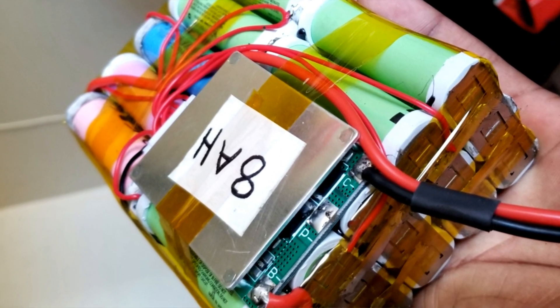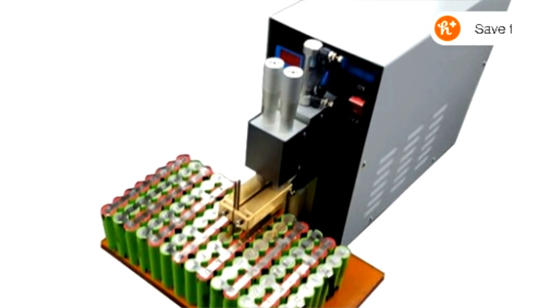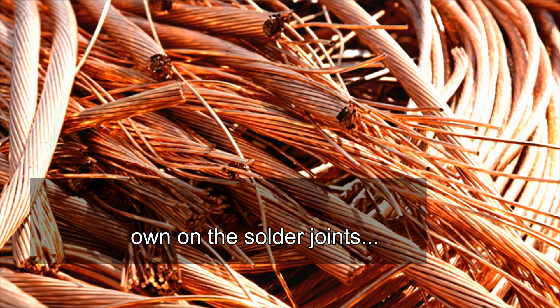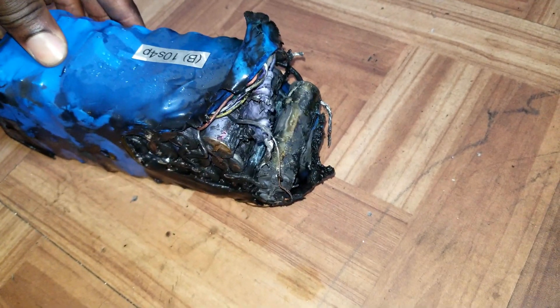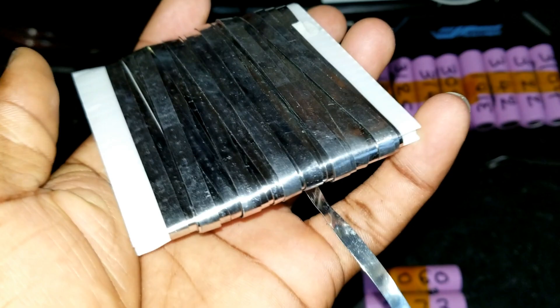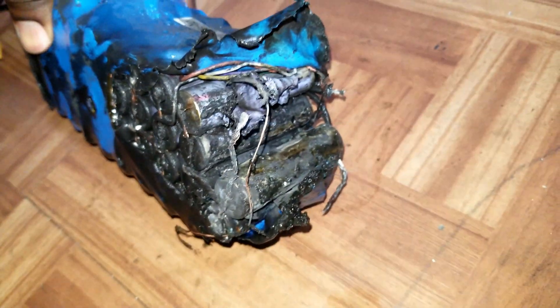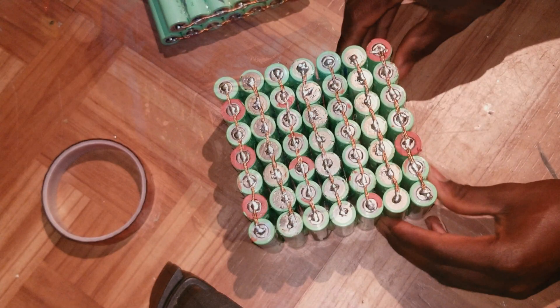Except if you are using a 1S battery. If you are soldering your batteries instead of welding them, make sure you stay away from stripped wires, as they can break the top caps of your batteries and lead to shorts which can cause fire. Instead, I recommend using tabbing wires because they are flat and thin, easy to solder, they won't look terrible like wire soldering, and they are safer because they won't rub against your protective caps and rip them over time.